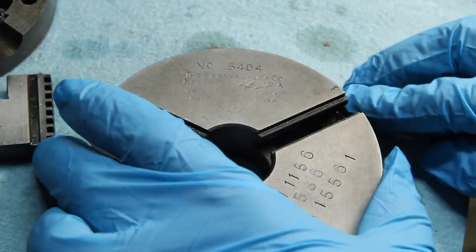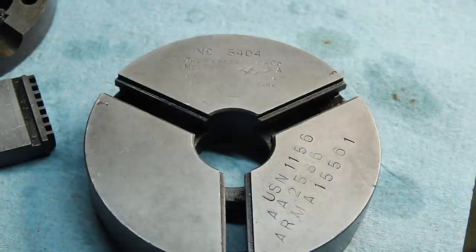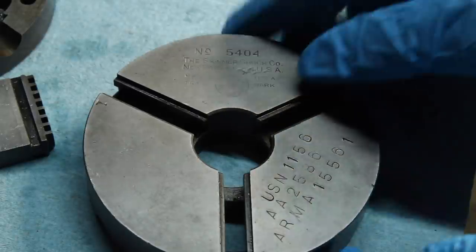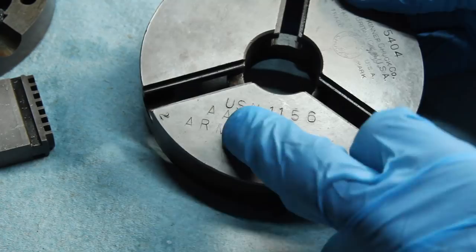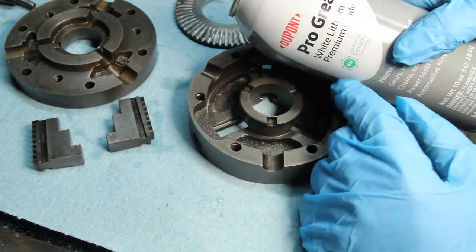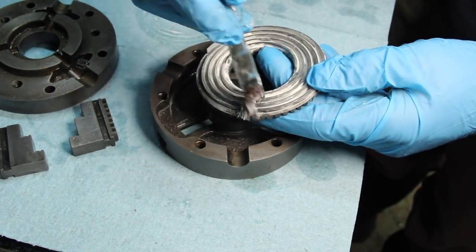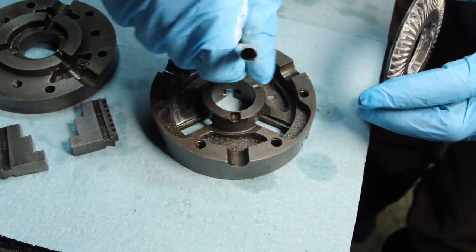I'm going to start getting these put back together and talk about the history of lathe chucks in America while we do it. So this one is from Skinner Chuck Company. I found a price list for this on Vintage Machinery — in 1955 this chuck cost $85, which is about $870 today. So good quality little chuck. It's also got some markings on here which I believe are U.S. Navy markings. Maybe someone that's a machinist mate can confirm or deny that for me. I'm using some of this pro grease — ain't nobody got time for amateur grease around here. Spray grease — I feel like this is like the cheese in a can. It's not the right method for applying it, but we'll go for it and see what happens. I've already got some grease in this scroll. You want just a light coat, which is why I'm hoping this spray grease works well.